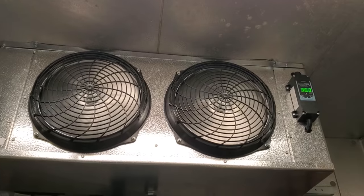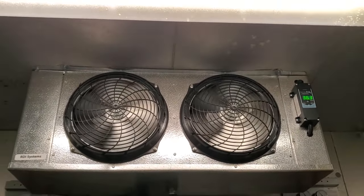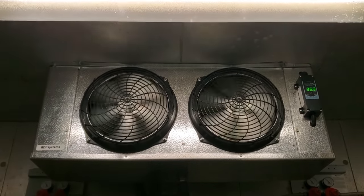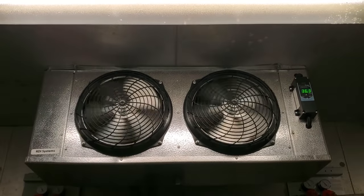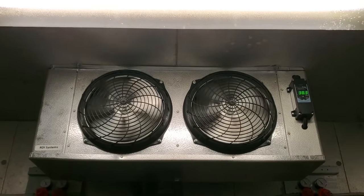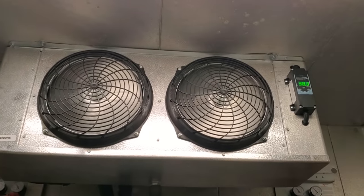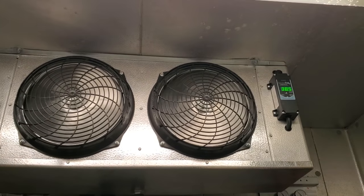So we're going to do a startup on this. I'm going to monitor the natural operation. I opened the walk-in cooler door and we're going to let this evaporator turn on. When it turns on, you'll be able to hear the difference — maybe not see the difference with the frame rate of the camera. The evaporator fan motor sped back up because we're calling for cooling now.